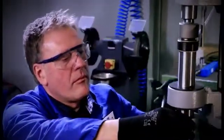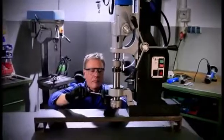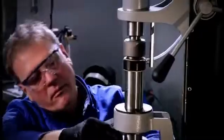The core drill, together with the ejector pin, is inserted into the cutter arbor and fixed by means of two clamping screws. For tools with a 19 mm Weldon shank, a bushing from Weldon 32 to Weldon 19 is available.